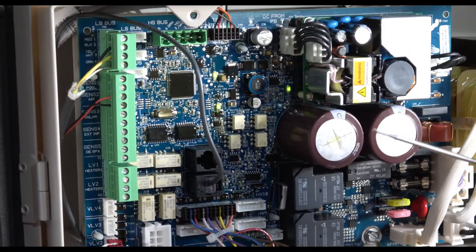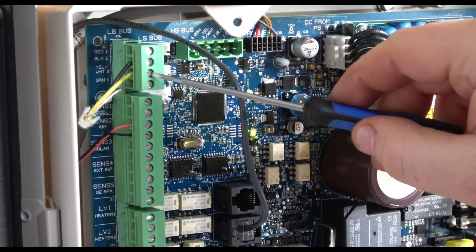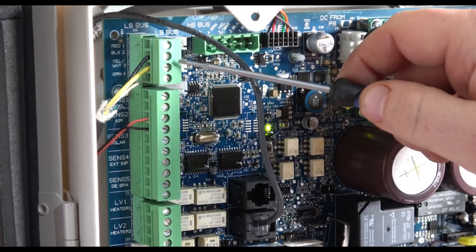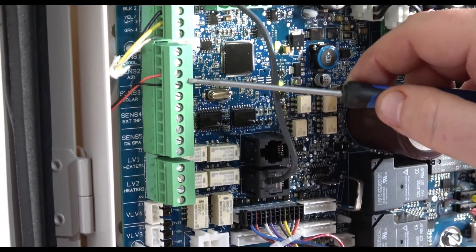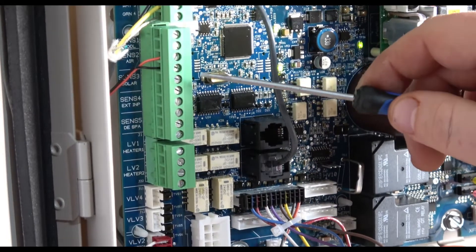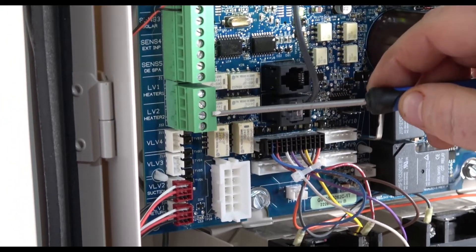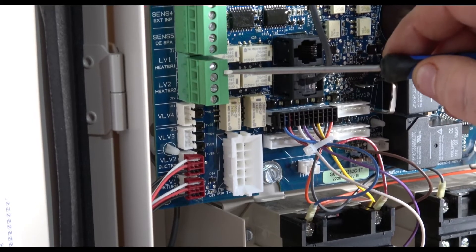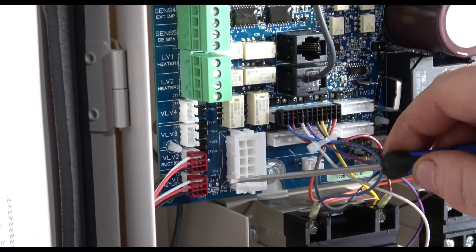Now for an in-depth look at the circuit board and where everything ties in. The smart relay four-pin connector is where the variable speed pump ties in. If you have multiple variable speed pumps or smart devices, twist their wires together — they all tie to the same four-pin connector and will all be recognized by the Omni. Just below that is the 10-pin connector for the air sensor, water sensor, and any other external sensors. Note that the red and black wires there — it doesn't matter which color goes to which port, it just creates a loop. Below that is the four-pin connector for the communication cables for your heaters, again a two-wire connection where wire color doesn't matter. Below that are the four valve actuator slots.